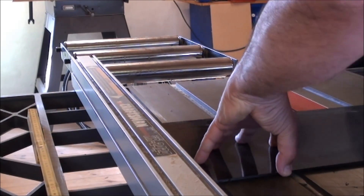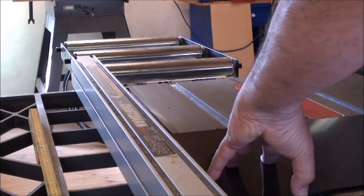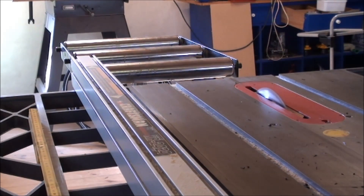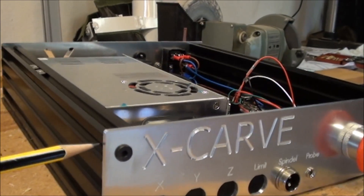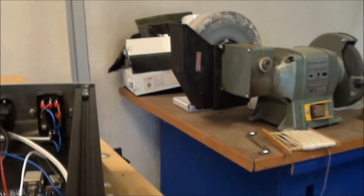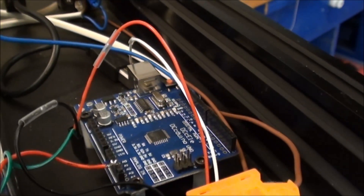Now I have to put the back on. After having done the milling of the front and back plate, I have assembled the box. I have here the 2060 profiles — I've put a thread inside so I can use M5 screws to put it on. Then I have made a plastic bottom, and the three screws you can see there are for the Arduino, which is put on some nylon stands with the original three screws to fix it.